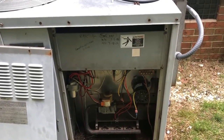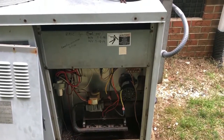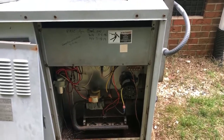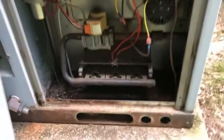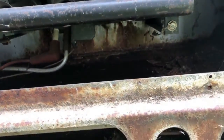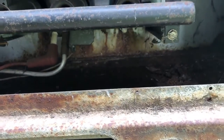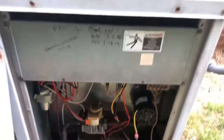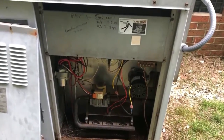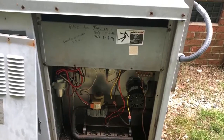For those of you with a keen eye, you might also say: what about your flame sensor? The flame sensor would cause that same problem. But the igniter switch — I'm not really sure I could show you that either. You see that gray panel there? You'd have to unbolt that — I believe that's where the switch is. So after watching several videos on YouTube, I was saying to myself that's probably my problem. That's why it's not lighting up.